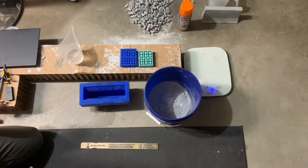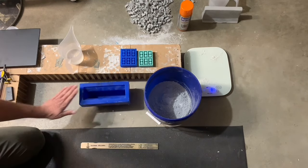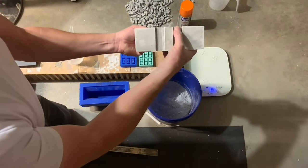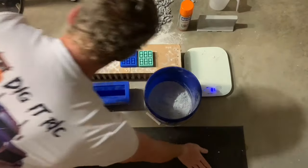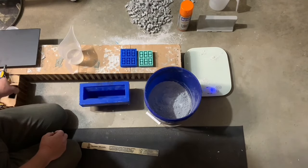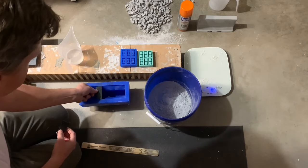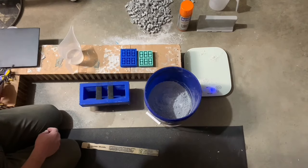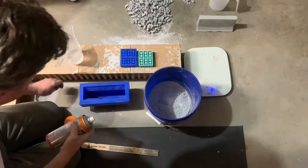You would want something to firm this up if you wanted to do a flat jersey. But as you can see on my jersey barrier, I've got the fork slots molded into it. I've got those pre-made right here, and that gives me the gap I need. I'll be putting these in. First, I'm going to give it a quick little spray with some silicone release.